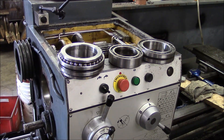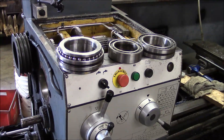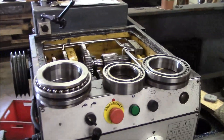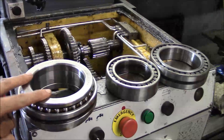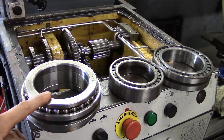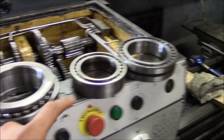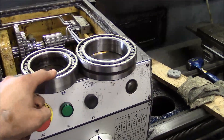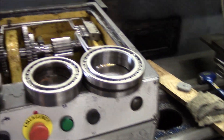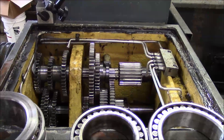I did not need another machine torn apart in my shop, but we definitely found a smoking gun. The thrust bearing has some minimal damage but definitely has some problems with the races — it's going to get replaced. The rear bearing is completely hooped. The front bearing is completely hooped. And we've got a couple of the regular ball bearings in the other shafts that are bad too.